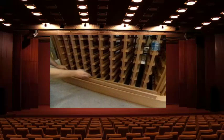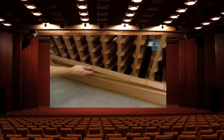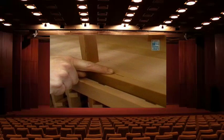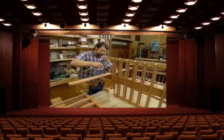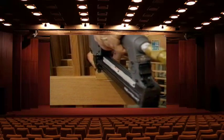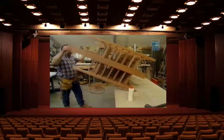For the last few minutes I've been working on the five cross pieces that connect the standards. The back has been dado'd for every standard location. I'm going to make one design change for the top cross piece: on the prototype I let the dado show through, but I'm going to rabbit the top edge so the shelf will conceal those notches. Now for a little assembly — a little glue and some one-and-a-half inch brads on the center cross piece, and then the one with the rabbit that supports the shelf.